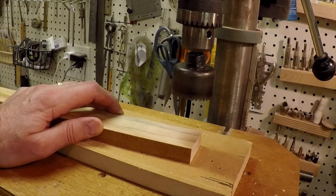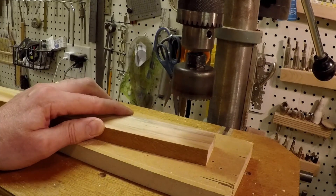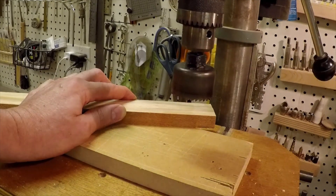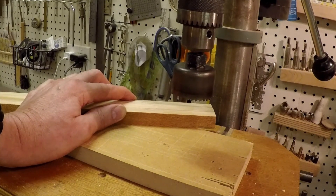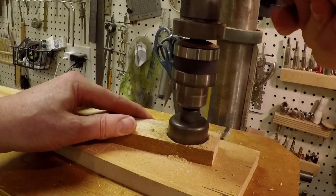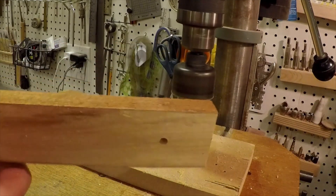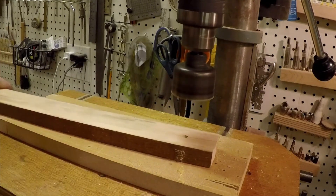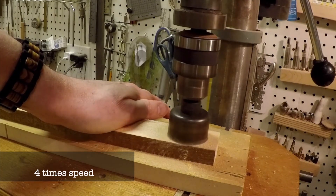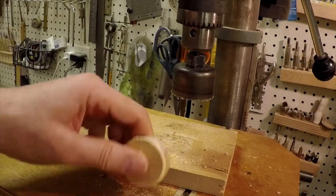Wheels can be made out of just about any piece of scrap wood you have — here I have a piece of reclaimed wood that I had lying around. The trick when cutting out the wheels is to make sure you don't run the hole saw all the way through on your first pass. Cut until just the center of the bit passes through the bottom, but not the rest of the hole saw. When done, flip the wood over and use that hole as a pilot hole. You'll notice I didn't cut all the way through, but the center hole is there. Now I'll use that as a guide, line up the saw, and cut out the rest of the wheel — leaving it just far enough until the wheel releases from the rest of the wood. And there it is — it pops right out. Twist it out and there it is.